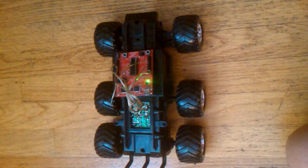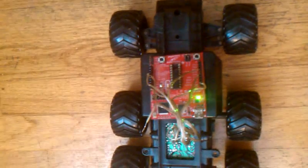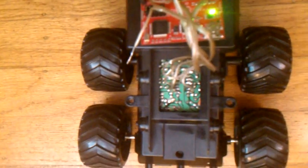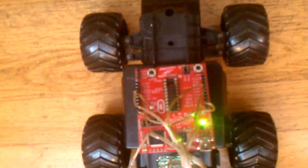I have a little toy remote control car here that I got from Goodwill for $2, and I've got my LaunchPad for MSP430 plugged in there. I looked on the internet and found the pin-outs for the remote control receiver chip that's in there, and just wired from the pins of my LaunchPad over here to the car.